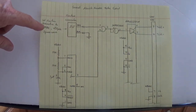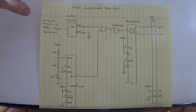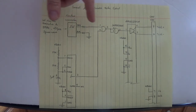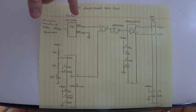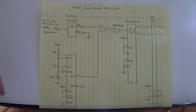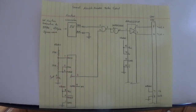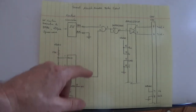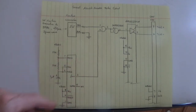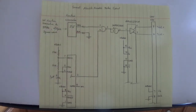It's set to 1 megahertz, plus 5 volts peak. The square wave will be from 0 to 5 volts. That's fed into one input of this NAND gate, 74HC00. I have a 555 timer circuit right here set in astable mode of operation. It's continuously putting out a square wave from 0 to 5 volts. That's being fed into the other input of this NAND gate.